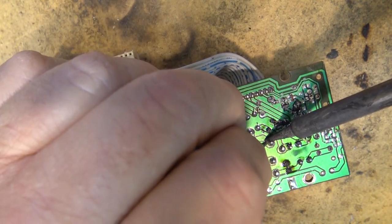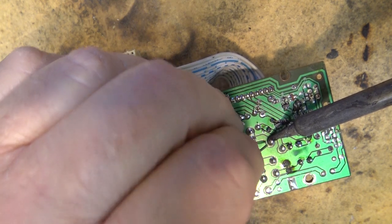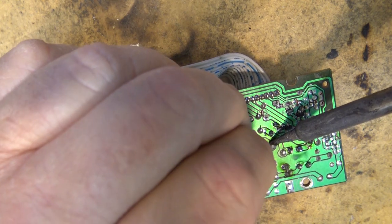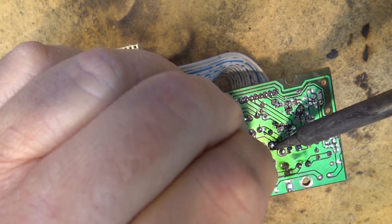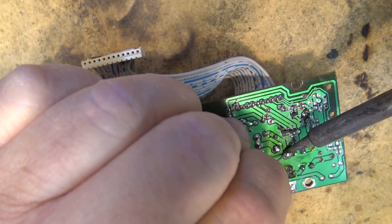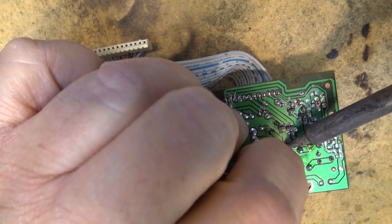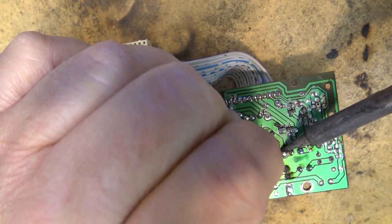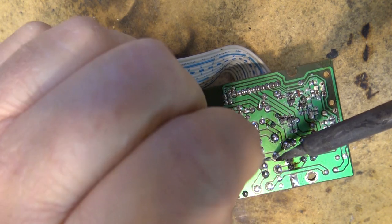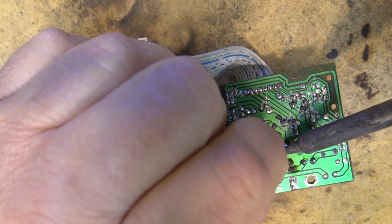We know this because there are outputs on this that don't go anywhere. There's outputs from the power supply on that header cable that would have been for different devices that aren't even being used, and the board's not even fully populated. So this is just a standard third-party power supply that they bought, put on this little board for this project to get these things produced as absolutely cheap as possible, because in a sense they were literally giving the things away back when the transition was taking place, back in, I think it was 2007.